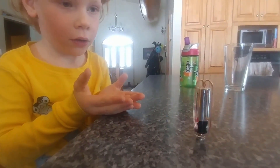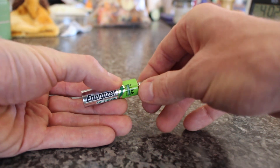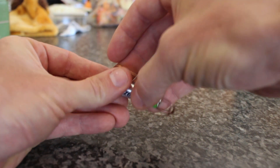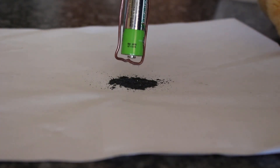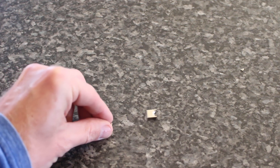Assuming that you guys have gone and done those experiments now, time to explain how the motor works. If you look at what you've built, you have a AA battery with a permanent magnet on the bottom. I think in the video you have a couple of different magnets, but when they're squished together like that they act like a single magnet. So you effectively have one magnet at the bottom, and then your wire that you put across from the top to the bottom makes an electromagnet. So you actually have two magnets now, and as you know, magnets push and pull on each other. The direction that these ones are placed in actually wants to push your electromagnet sideways.